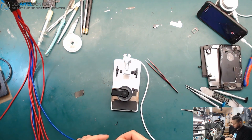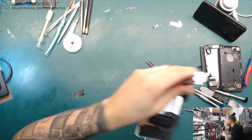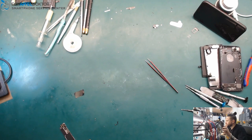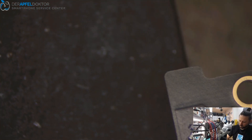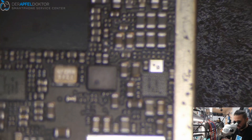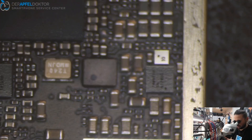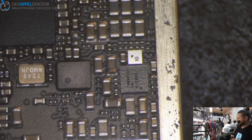Okay, now we go straight under the microscope. After I have finished that, I will do an iPhone 6s CPU because of no image, because of broken MIPI lines. And you can see it here — this capacitor looks not good, just an exploded one.